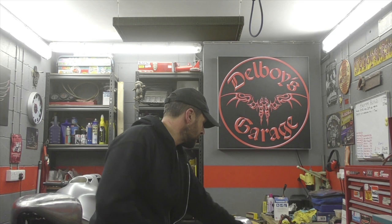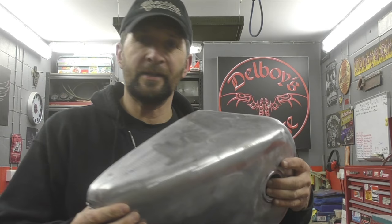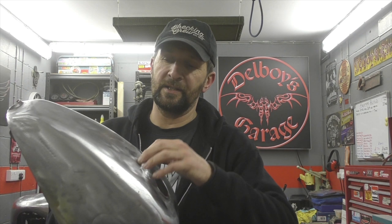You look at the finish you get, it's got little swirls all over it. But they're only literally little blooms in the surface. They're not scratches. If you use a flat disc, then you're putting hard sand against it, and you see sparks, which means you're taking the metal away. That's the last thing you want to do. All you want to do is take the soft paint off. So great stuff. Use those sanding fleeces to take paint off on metal parts, obviously.